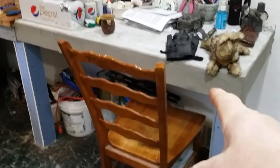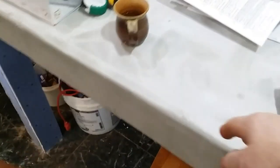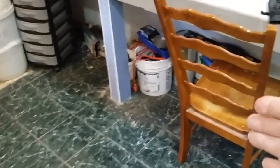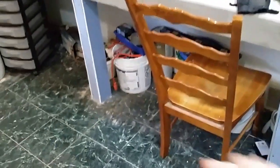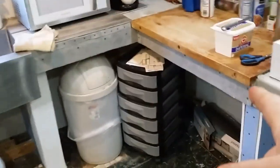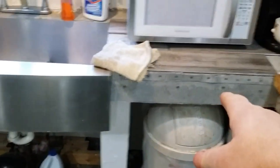I made that last night — that is going to get tiled. Basically what this is, is one inch of cement board with a thin-set coating on top of it; that's the way it's prepped for the tile. That way we'll have a couple bar chairs or bistro chairs and we'll have an eat-in kitchen finally. The butcher block I'm going to refinish — we're going to sand this down, refinish it, and as you can see we've got our cement board on the face.